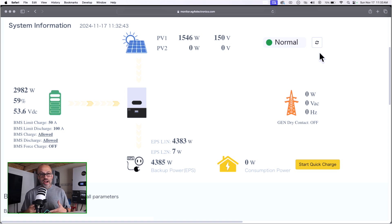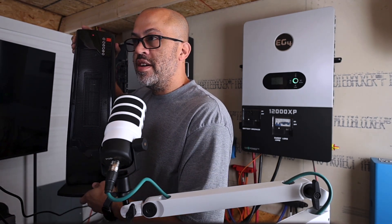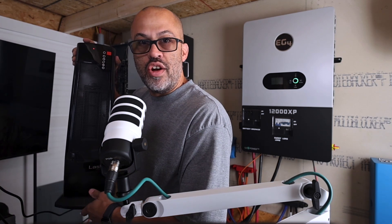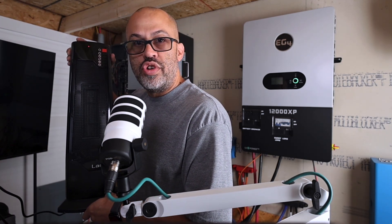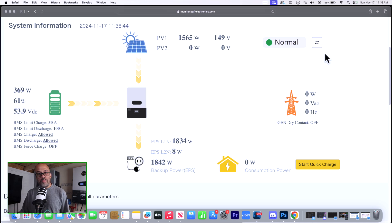Let's see if I can find a few more things to add and get this thing over 6000 watts without a problem. Of course it's not doing any active balancing — that was a mistake on my part in the other video. I've got another electric heater, and I also have a heat press that I use to make metal prints. I'm going to turn that on and show you it's on leg one. Right now that heat press is pulling about 1800 watts on L1 — bam, as you can see, the heat press on L1 is pulling 1800 watts.